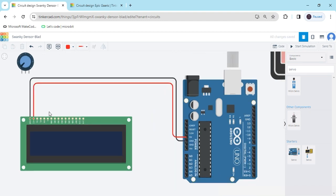On the LCD you can see this is the contrast pin. The contrast pin connects to the middle pin of the potentiometer. Change the wire color to yellow. Terminal 1 and terminal 2 of the potentiometer — any terminal connects to positive and any terminal connects to negative; it depends on you. Terminal 2 is connected to positive and terminal 1 to negative. Potentiometer is also connected.